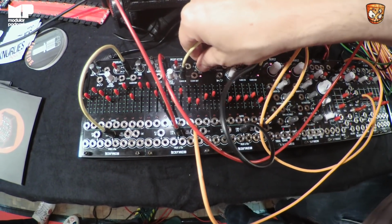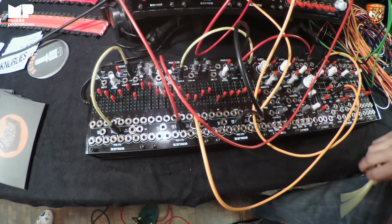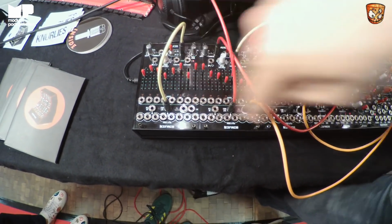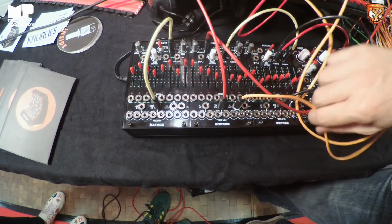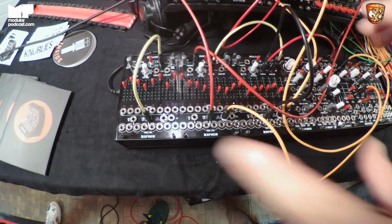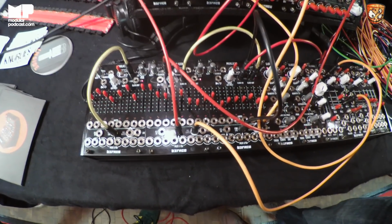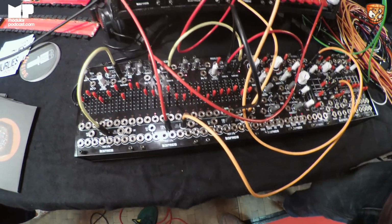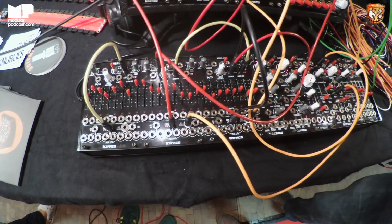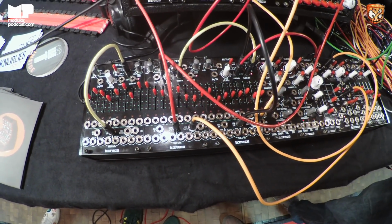Really controllable for how clocks are handled, like I said: division, multiplication, switching, sequencing. You also have an end of cycle and a one-shot play, so you can link many together. You can have the end of cycle of one going to the one-shot play of the next, and so on. So you can have 2 or 3 of them running and make a bigger sequencer, and build the switch or sequencer that you need. It's also convenient in music to have one sound that answers another, with two sequencers running, one like a call and the other the response.